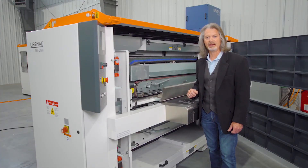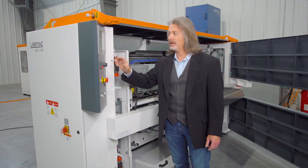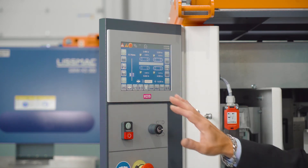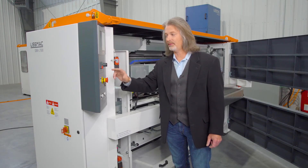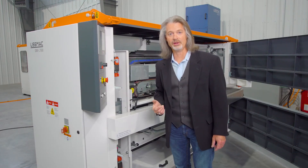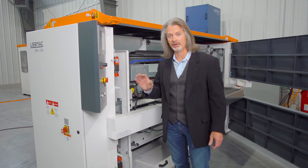Key features of the Lismac LG1S2 include a large color touch screen control. From the home page you have access to all of your tools — you can turn them on and off with a simple touch, select tool positioning, adjust infeed speed, set part thickness, monitor maintenance, monitor amps, and save programs. We also have an on/off switch and emergency stop button. An optional barcode scanner allows you to create barcodes corresponding to a job so that you can access a saved program by scanning the code and have machine parameters set automatically without manual interface.